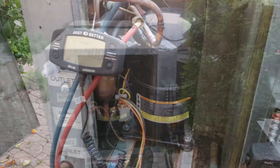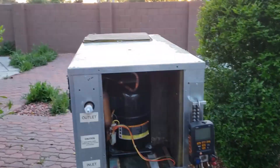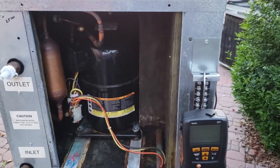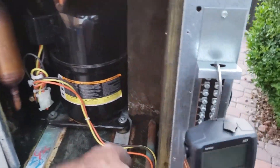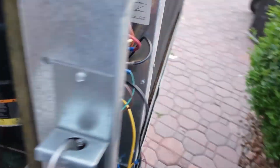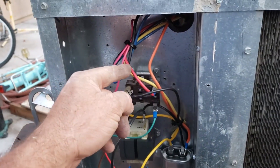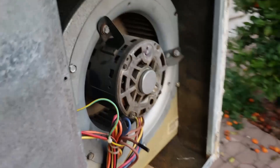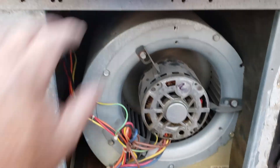I ran out of light - that's the way it is in the spring. Got the panel on, compressor vacuumed down to 400 microns. I dropped two and a half pounds of refrigerant in there to break the vacuum and leave it that way. Compressor wires are pre-wired over here. I put a basic transformer back into it with a 9340 relay going to low speed on the blower.